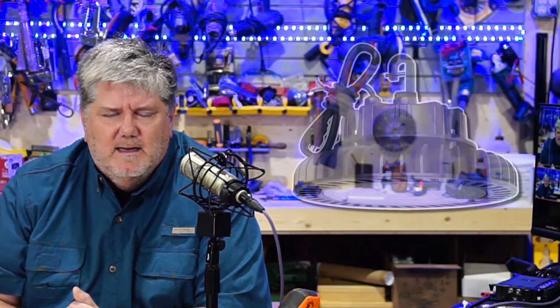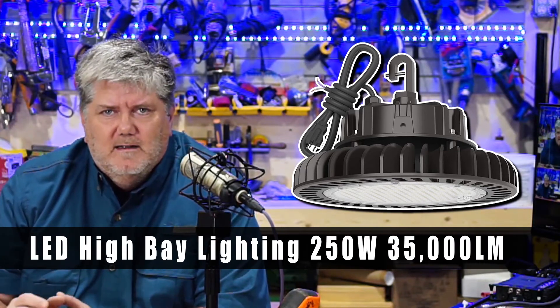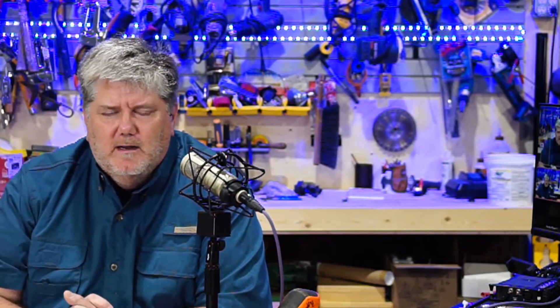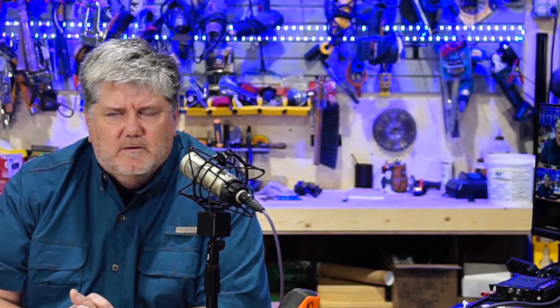I found Hyper Lights — that's the brand — and the ones I used are 250 watts each. They're good for ceilings up to about 24 feet, so I have them up very high and needed scaffolding to get them up there. I have six of them in this part of the barn. They've got a good color temperature of 5000K, which is roughly daylight.